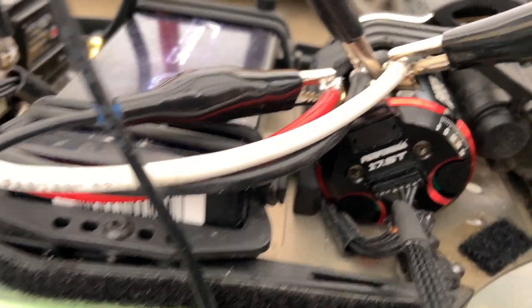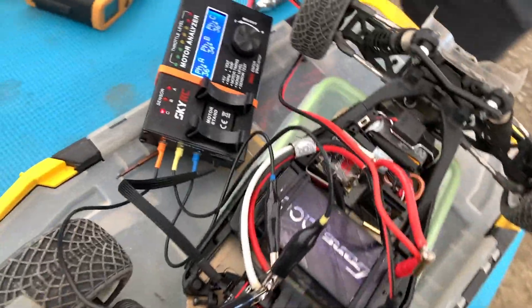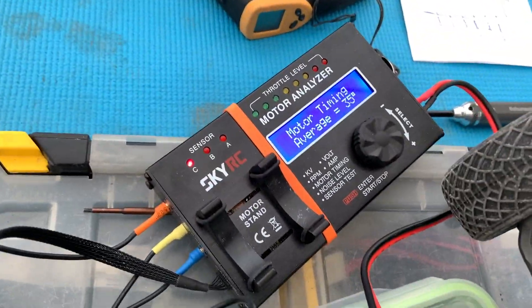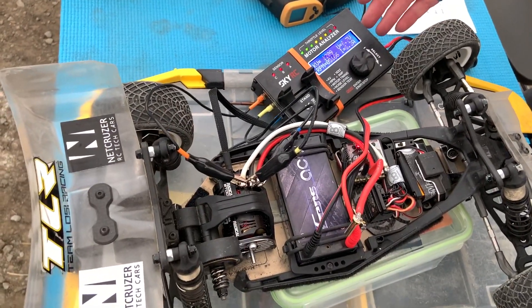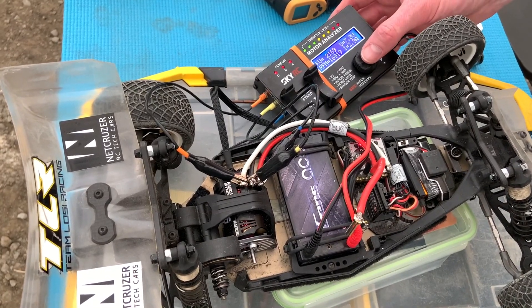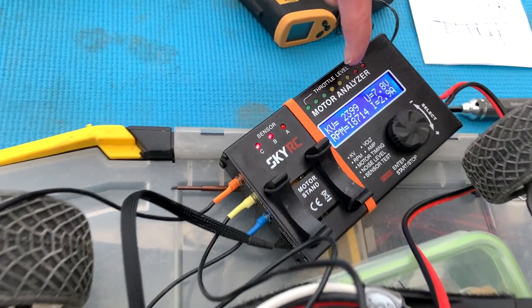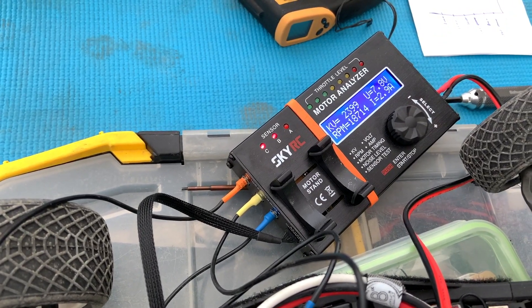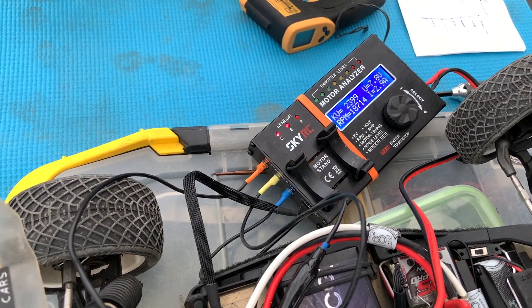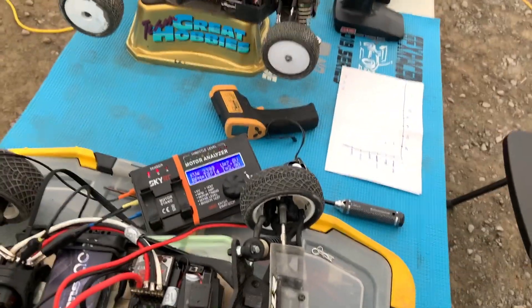So the sensors are even, but on the end bell it shows 20 — 20 is really 35. It's interesting that the gauge is so far off. We let it max peak, stop it, and it stores the last number. KV was 2400, voltage 7.8 — that's just your battery — and current was only 2.9 amps, so it's very low current right now. RPM is just your KV times your volts. We'll start dialing up the timing and see where we get.